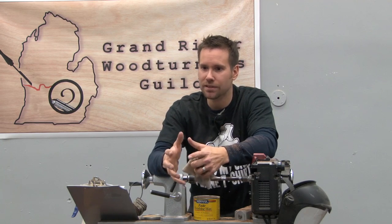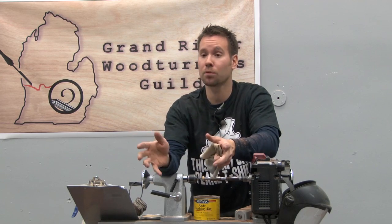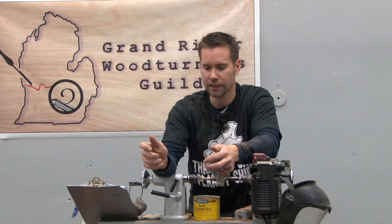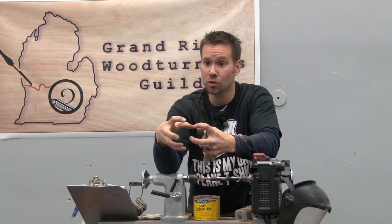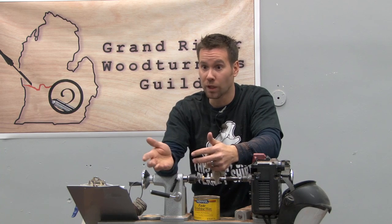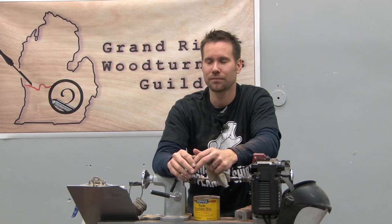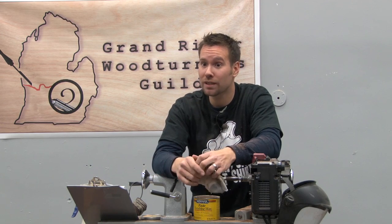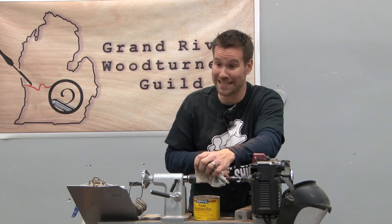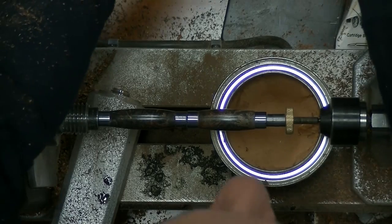It's not very dense. And so what they do is they stick the pen blank coated with a resin in a pressure pot, I believe. There's a different way of doing stabilizing, but in my experience, the resin soaks into the wood, making it essentially 50-50 wood and resin, just really hardens it and makes it a stable piece of wood at that point. Makes it continuous throughout the entire thing. And then this is also dyed brown, and so that also is impregnated into the wood.